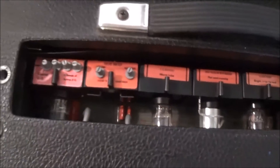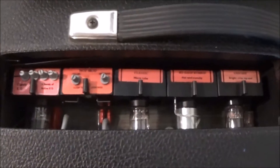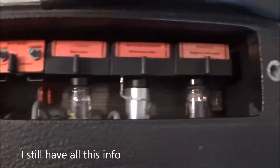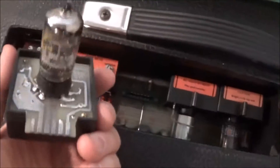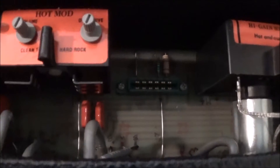Over the years I picked up a lot of these off eBay, and I actually made a few of my own. I had on my website the amp completely reverse engineered — all the schematics for all the preamp modules and the whole works, how you can modify the thing. You can pull out this one and see this little preamp module — it's like a little self-contained module with a tube. Some of them are solid state, like this hot mod right here, which has a power transistor. It kind of gives you sort of a Marshall-y sound.